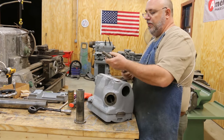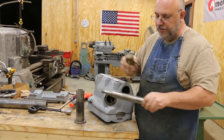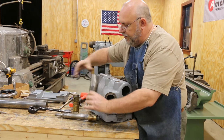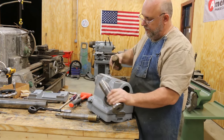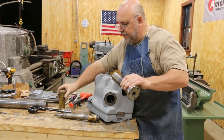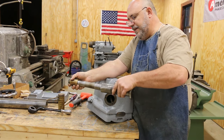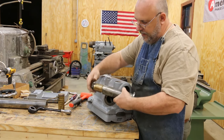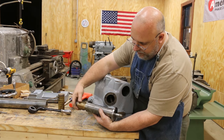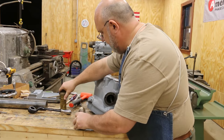You've got this sleeve here that holds everything together. First thing I'm going to do is coat this thing down with a good coat of oil — we always want to make sure things are lubricated well, and now's a really good time to do it. There is a means to lubricate this on the machine, but I like to make sure we're starting out good. There's a little hole right there — I'm pointing to the place you put the oil in — and that drips down through there and keeps everything lubricated. So with it lubricated, I'll go ahead and take the shaft and put it into the little holder here. It's a really nice tight fit, and with some lubrication it's turning real well.